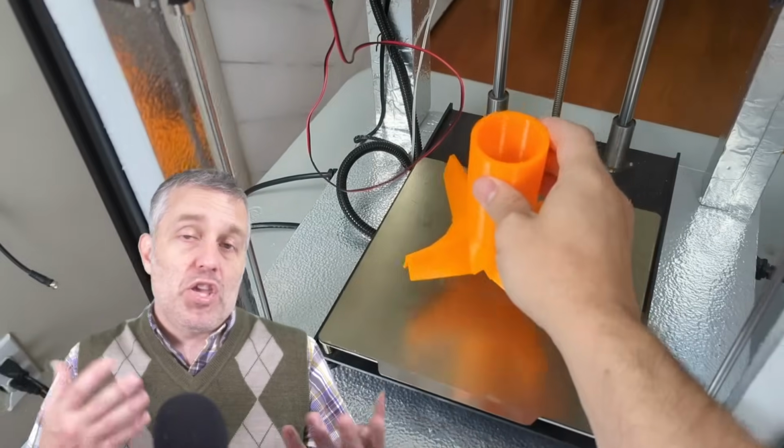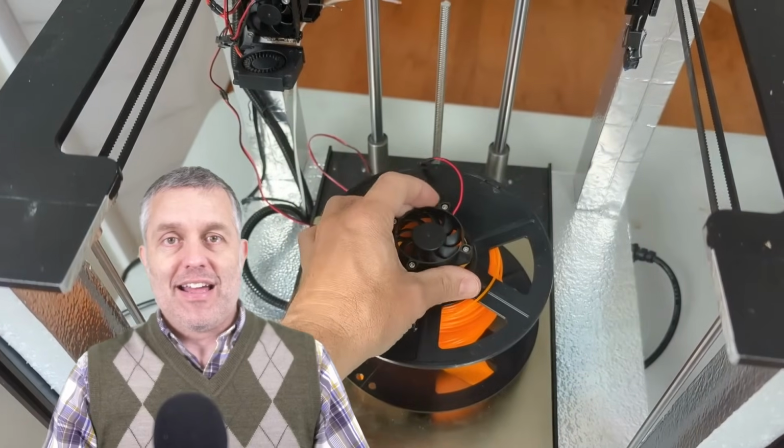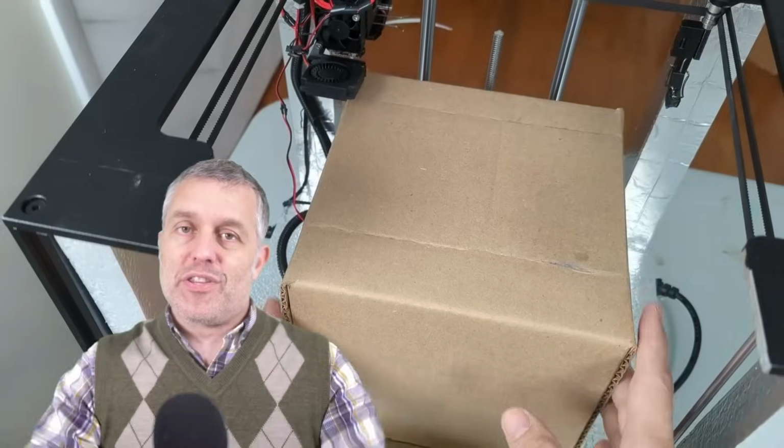One, you keep the PETG filament very dry, or you only print with a brand new roll of PETG filament, or you wipe your nozzle. And with the right slicer, that being SuperSlicer on GitHub, you have the ability to have that nozzle dart off to the side and wipe on the brush every couple of layers or something like that, just to keep that nozzle clean so that you avoid this problem. But you might find it just easier to dry your filament before you're printing with it. And hey, I have a video about a really inexpensive filament dryer also in the description down below.